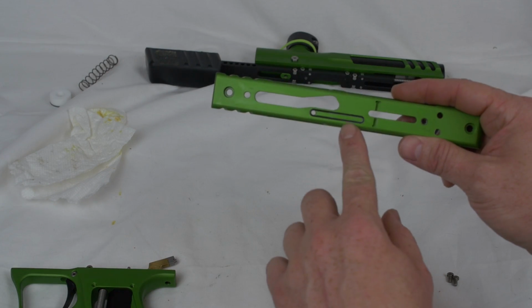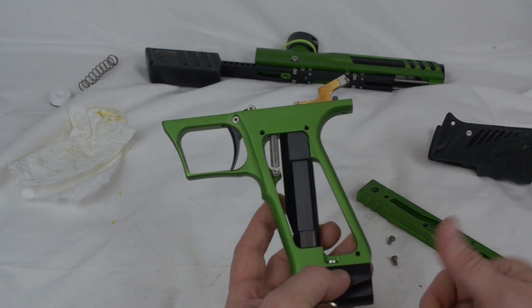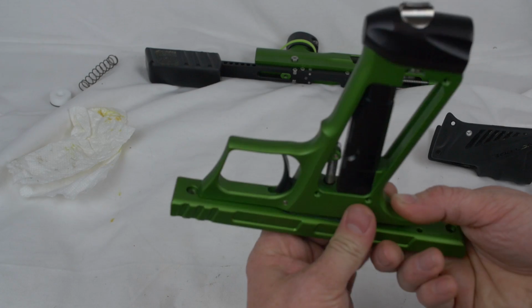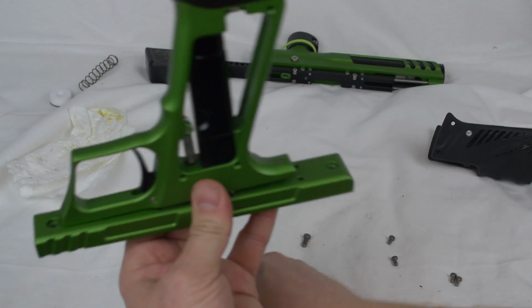Now, if this guy blows out, if you're actually having the seal blowing out of place, you typically have something wrong with the regulator. Before you screw anything down, make sure your dowel pin's in the right spot. Make sure it's not too far out on either side.